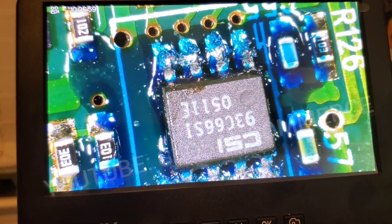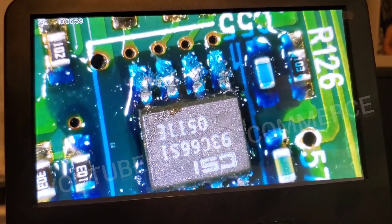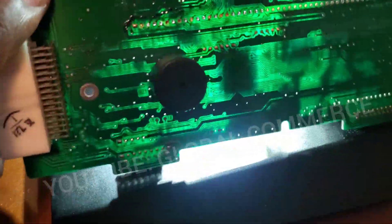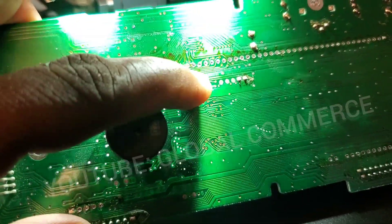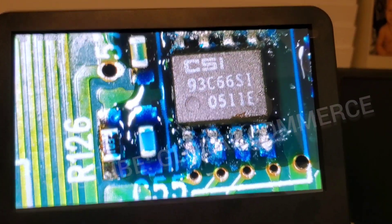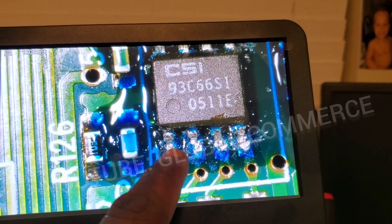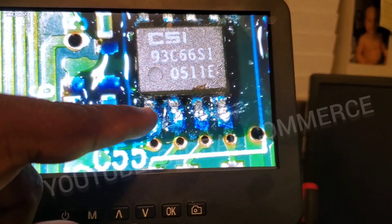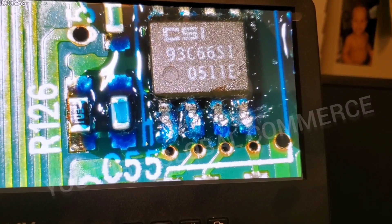I went ahead and pinned this out and found most of the traces for the EPROM, so you probably don't even have to desolder it — you can probably hit it from right here on the back. I flipped the board around and we can identify pin 1 by this little dot here. Also, the chip is beveled — this side is slanted down, which also designates pin 1. That's how we know that's pin 1.